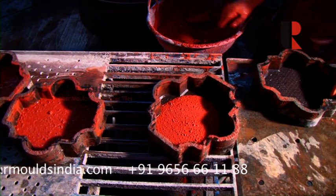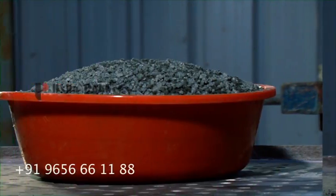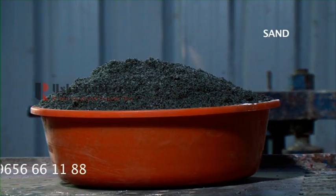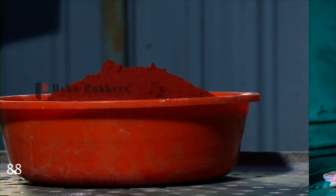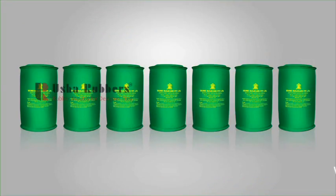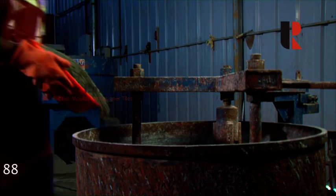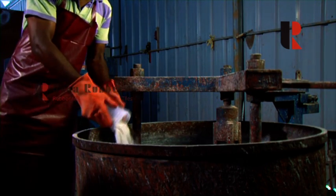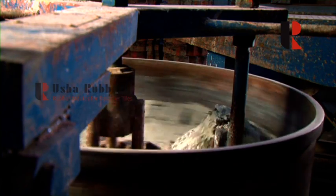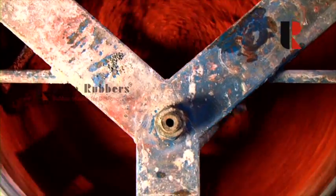The top coating of the first line — the mix uses white cement, baby gravel, 6mm sand, waterproof powder, oxide, SBC chemical, and water. All the ingredients except water and the chemical are mixed in the pan mixer for 20 minutes. This process is called dry mixing, since water and chemical are mixed and kept separately.